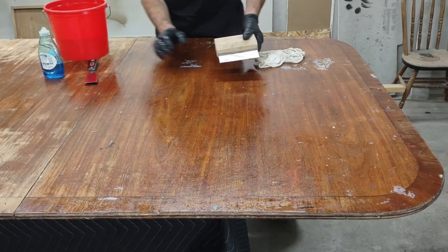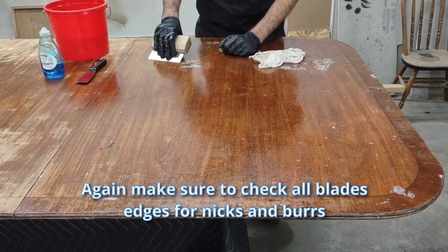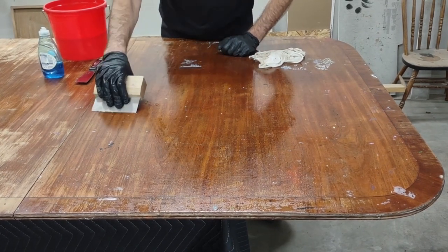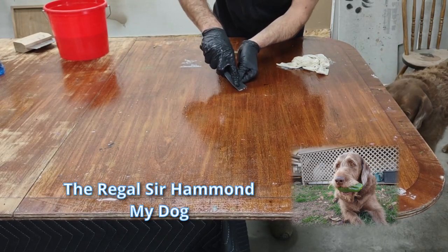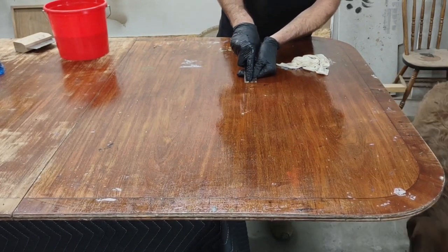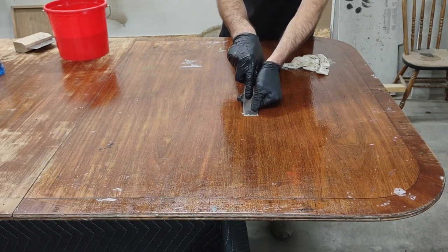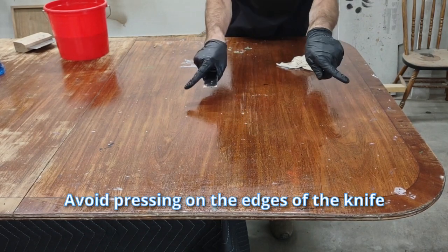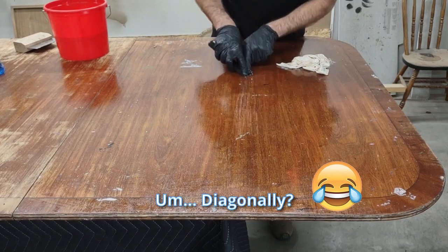This blade is pretty good. I like to take the big stuff up — don't push too hard. I'm pushing against itself. I literally just pop glitter right off. Using the knife at an angle when you're scraping is a great way to prevent stop marks — straight lines from scraping straight across. If you scrape straight across, the edges will tend to want to dig that way.